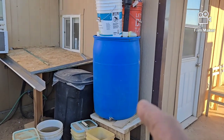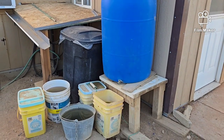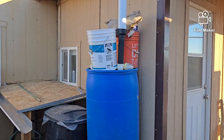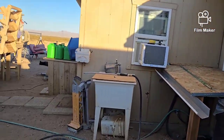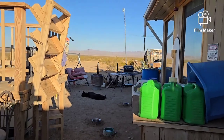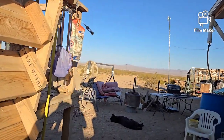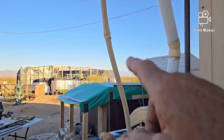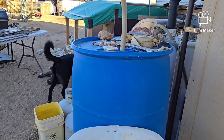On each corner of my cabin, I have a 55-gallon plastic barrel. I drilled and threaded a hose connection in the bottom for draining them. I didn't put first flush on those because that water will only ever be used for irrigation. I have one on each corner of my cabin, except this one corner where I do have a first flush on it, and it has two barrels because this is the largest part of the roof. Once the first barrel goes through the first flush system and fills up, I open that valve and the second one fills up — giving me 110 gallons on this corner.